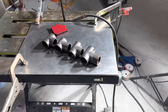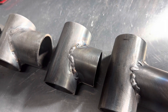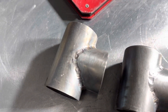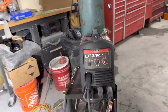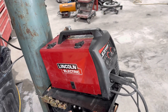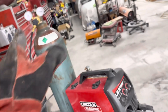Let's see if I can do that one better. Day one of self-taught welding class — I'm not thrilled with any of this. My first weld is pretty bad, then we move to the second — slight improvement. Number three is a pretty big jump in quality. What I found was I think I had my gas pressure turned up a little bit too high. By the way, I'm using a Lincoln LE 31MP multi-process welder — it's what I've been using for all my MIG wire feed. I've ordered a new Everlast 210 EXT TIG welder, which I'm going to use exclusively for TIG, and I'll use the Lincoln strictly for MIG. That way I can have both welders set up and won't have to keep changing gas bottles back and forth.